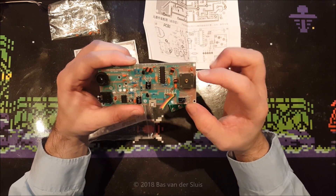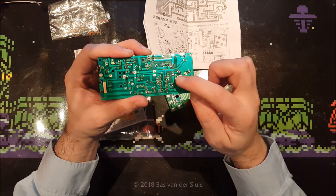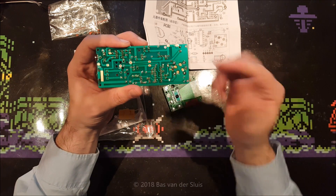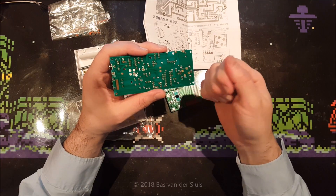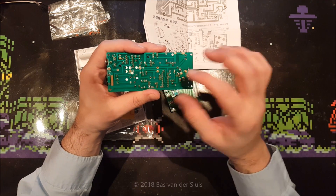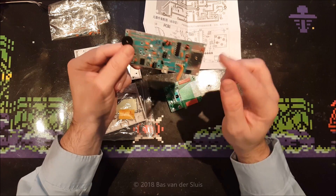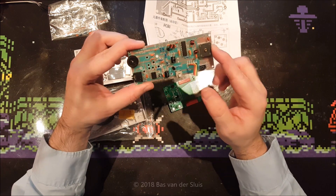This component was a real pain to get on there because the solder wouldn't hold on the four pins. The two outer pins were fine, but the inner ones just didn't take any solder — the blob was forming all around the pin. What I did was scrape away some of the coating on the pin with my pliers, and then soldered again, which went better. I'm not saying it went perfectly, but it took solder. I'm hoping it's making good contact now. All the other components went absolutely fine, but this one was a real pain.